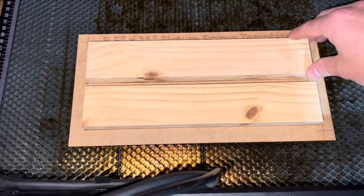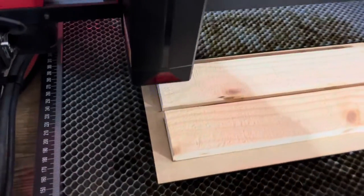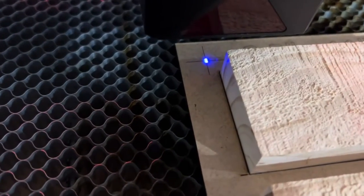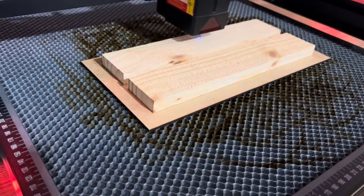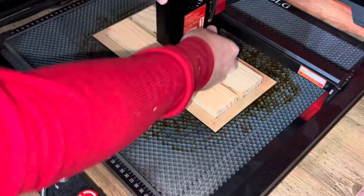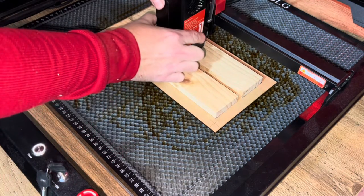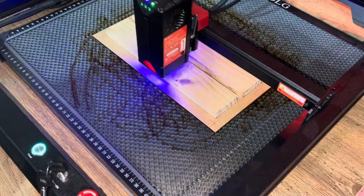Place the top and bottom sections of the outer frame inside the template. Fire the laser and align it to the crosshair marked on the template. Once one is aligned, move the laser to the opposite side and you can pivot the template to align the opposite corner if needed. Hit frame to ensure your template is centered. An awesome feature to save more time is the spring-loaded focus stick — simply pull down on the lever to lock it and set the focus, then push the button to release it. After setting the focal point, simply hit the start button to start the job.